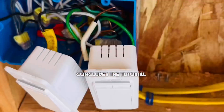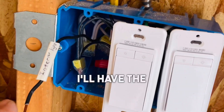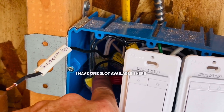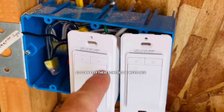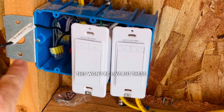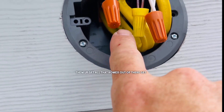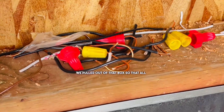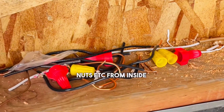That about concludes the tutorial. Now I'm going to get these put in — we have the room, we can get those in. I'll have one leg still remaining for the one switch, which will be the interior. I have one slot available there to draw the power into that interior. When you make up a box, you don't want all that Romex in there — you want to cut all these wires, clean them up, get all that Romex out of there, get them pushed to the back of the box. Here is the excess that we pulled out of that box — all that was saved room we got in there by eliminating excess wire and wire nuts.